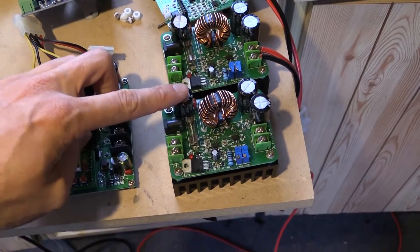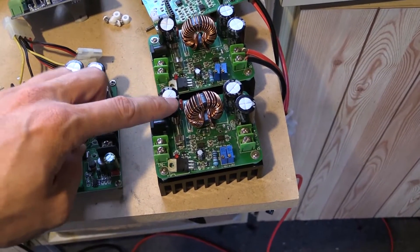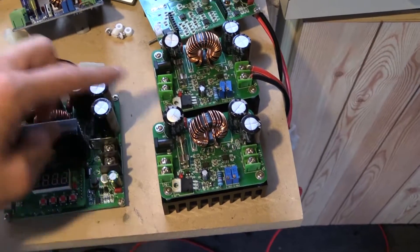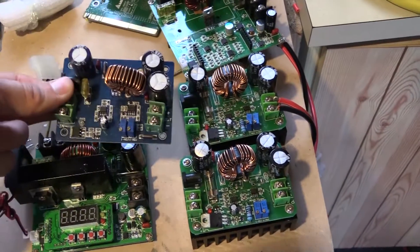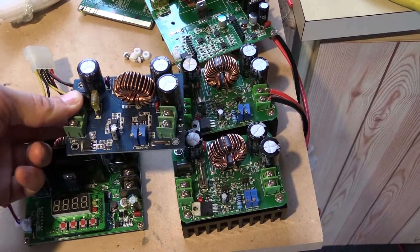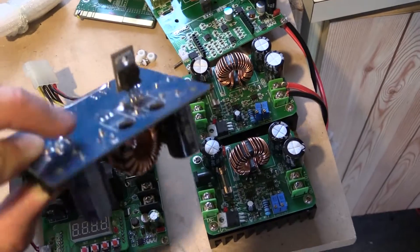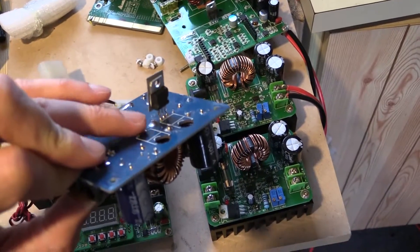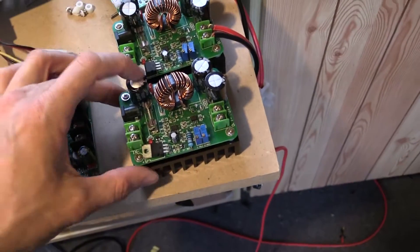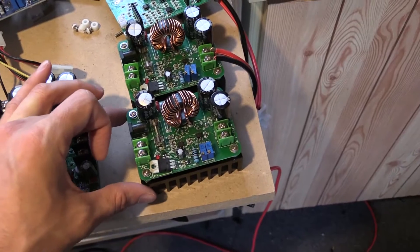What I did was I ended up blowing this one up. The fault with this one was the power MOSFET — it uses almost the identical one to this one here. Given that this cheaper one is not that stable, I took it apart and unsoldered the power MOSFET to put back into the blown unit. I soldered that back in and now this one is back working again. That's one accomplishment.